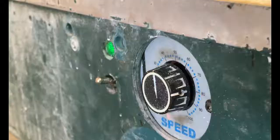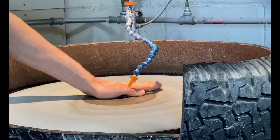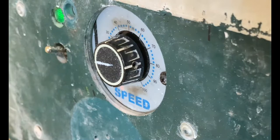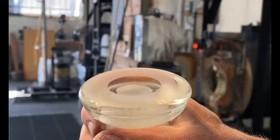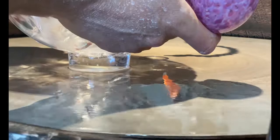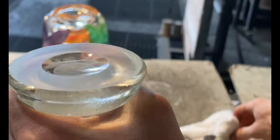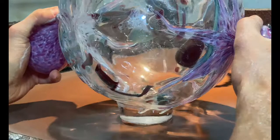You'll have to get one of these bubble levels too — it's necessary to really get a perfectly flat bottom. I'm going to switch to my finer diamond, get it nice and wet, and start working on polishing up those other pieces to a high polish. Here I am on the next wheel taking it to an even finer polish, and the next one will be the cerium that will take it to that high crystal-clear polish.